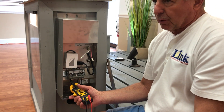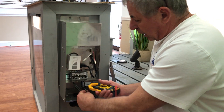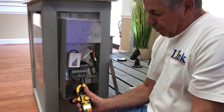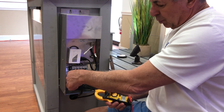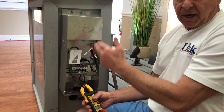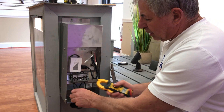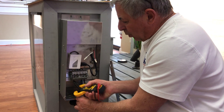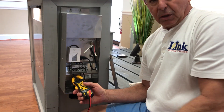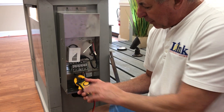You can clamp all the wires coming out of the common — so now we're at 10.7 amps. Each one of these runs has got about five and a half amps on it. You could also clamp the tap side — about the same reading, 5.5 amps. But what you can't do is clamp both wires on one line because the signal cancels itself. So when somebody says take an amp reading, you're going to clamp one or all of the wires in the common — that's how you tell what the load is on that common.